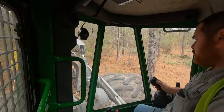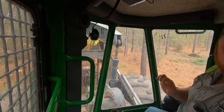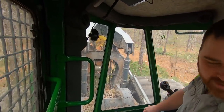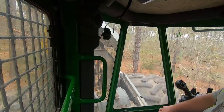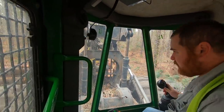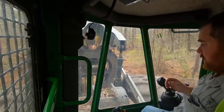It determines how far the boom is moved, and right as it gets to the end, it creates like a cushion on the boom. Instead of slamming like that, or whenever you steer it fast, it would create like a cushion, and you won't slam the machine so hard. I think that would help with pins and bushings and the longevity of the machine.